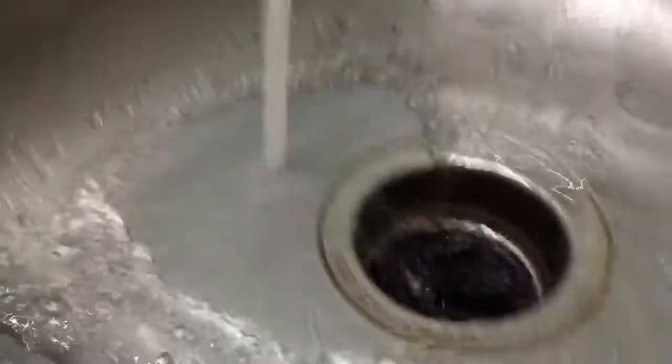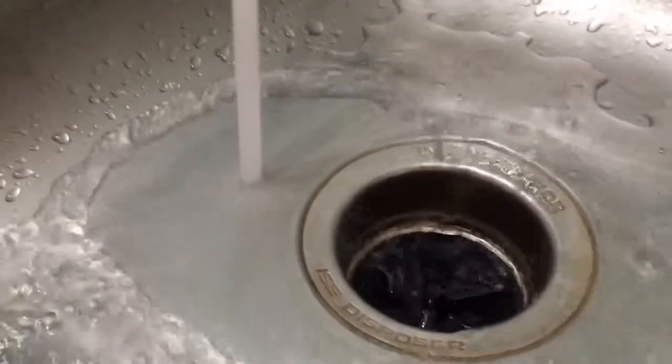So you want the power back off? No, it's fine. Okay. All right, so we run the water, go underneath here. You want to check for leaks, make sure everything is kosher, that you don't have leaks from your drain right here or up here at the top anywhere. And if that's all good, go ahead and hit the disposal. We got a switch right here. Sounds way better than it used to.